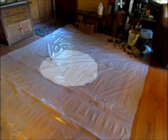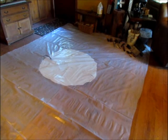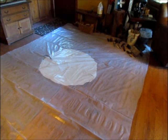I will say too that the plastic is 4 mil. Rather, that's going to be heavy enough. All I want is to protect it from being on the wood and the ceramic tile underneath. When we get all done, whatever is beyond the concrete hearth, I will try to trim off so that we can't see the plastic. But I have a tendency to change my mind later on, so this way the concrete will not be stuck to the floor, and it would allow us to move it around a little bit if need be.